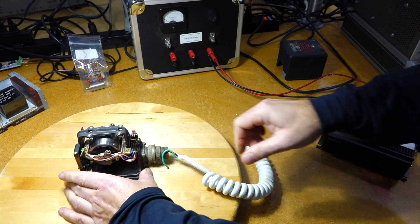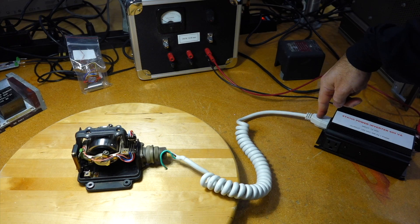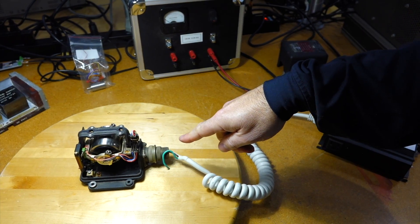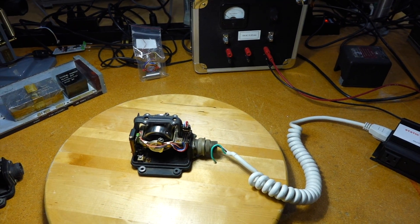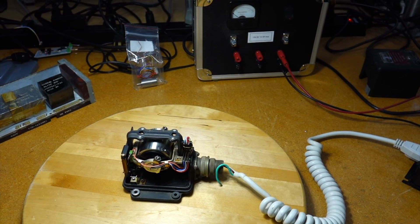In engineering we trust. So 12 volts from here, into the inverter, giving 120 volts at 400 hertz AC. At 400 hertz with a synchronous motor - times 60 - it should spin at 24,000 RPM.